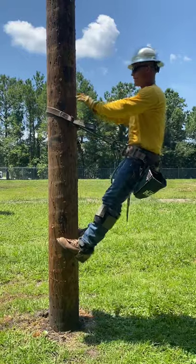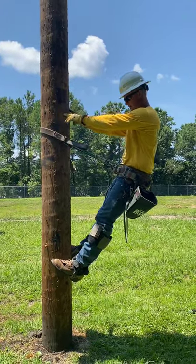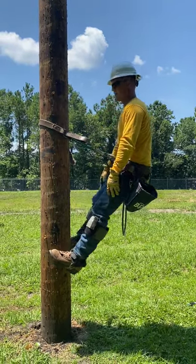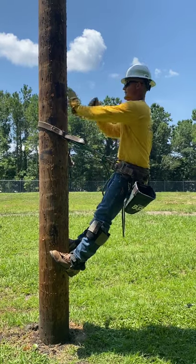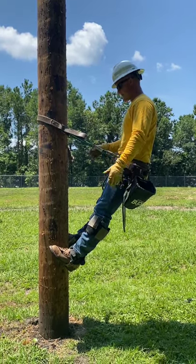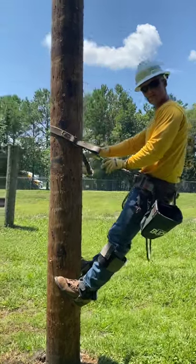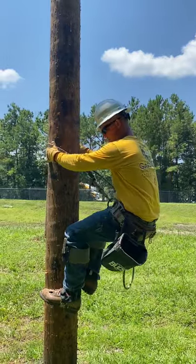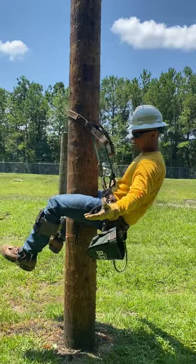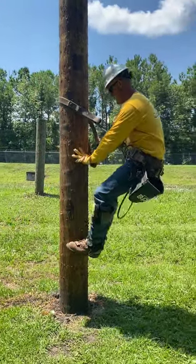If I'm going to be working on something up here, I don't want my legs bent because my legs are going to be dog tired. If I keep my legs locked out, I can work and stay up here for a long time without my legs getting tired. It's important to have the buck squeeze adjusted right — if you get inside the pole and your legs kick out, it catches you. You have to trust your equipment. You push right out on the center of the pole, and it brings you right back in.